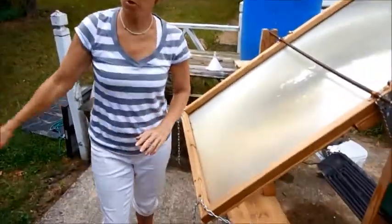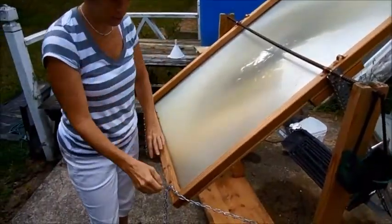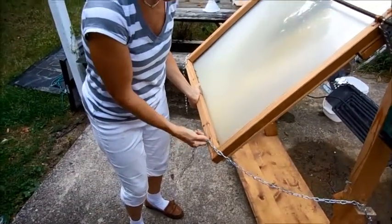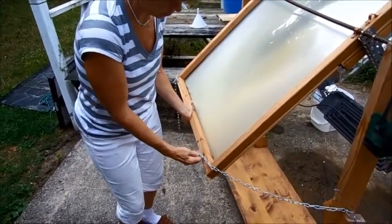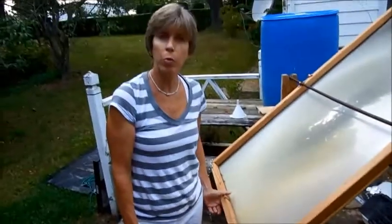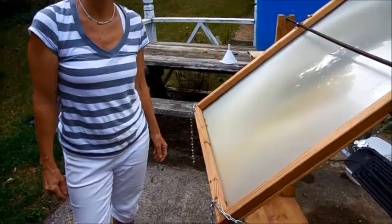Seasonally, as winter approaches, the sun's elevation in the sky will go down, so you have a more acute angle, and you want to raise the lens correspondingly. To do that, you simply adjust the chain to move it a notch. You have to do that on the order of every few weeks — a seasonal adjustment is required. If you didn't change it, the sun would stop hitting the pipe, the water would not be heated, the thermostat wouldn't open, and nothing would come out.